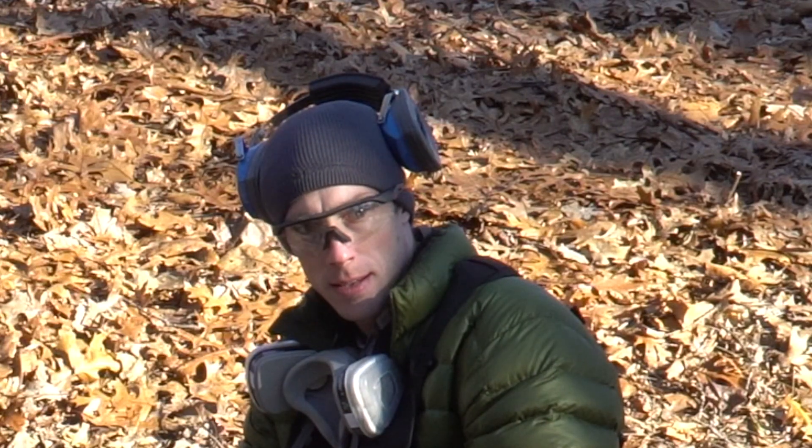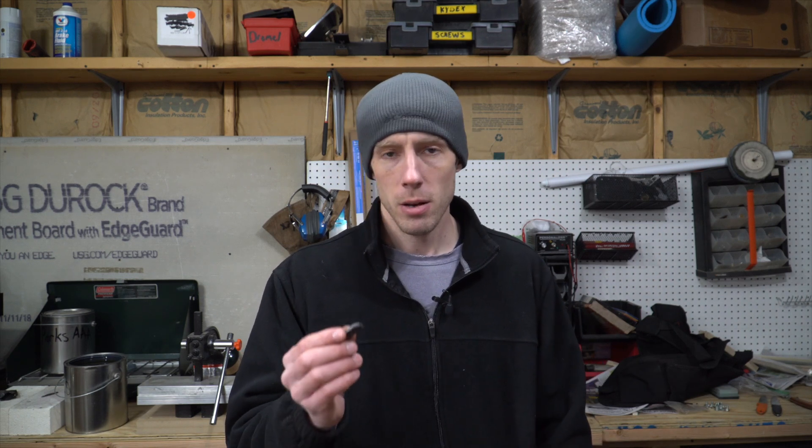So what's the takeaway here from the $25 crappy Damascus knife from eBay? I think the takeaway should be that heat treatment is the most important aspect of a knife, because even with a complete mystery steel, we were able to refine the grain structure and harden it somewhat. If this knife had that same procedure done from the factory, we would have had a much better knife that we could have sharpened and actually cut something with. But because this knife had absolutely no heat treatment performed on it from the factory, we weren't even able to sharpen it, which means it's not even really a knife. Heat treatment is the most important part of a knife. Thank you guys for watching and we'll see you in the next video.